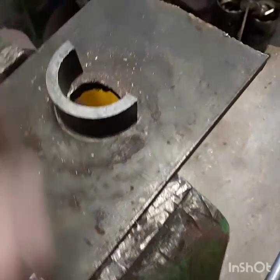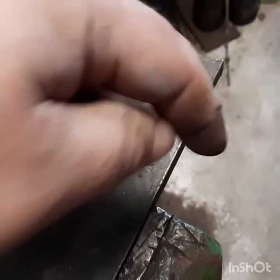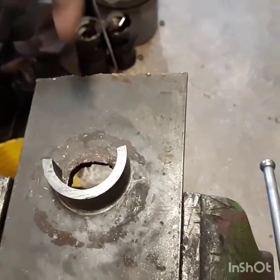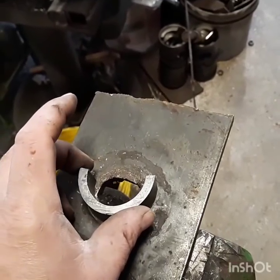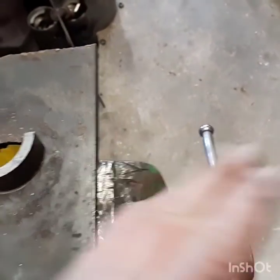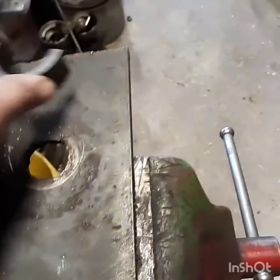I'll torch this plate to fit the bushing. This top piece will go away; I'll torch the plate to fit and come across the top, because there's a lot of weight on that piece so the concave bushing can't just jump up and out. I might rotate this a little bit because there's a tremendous amount of force coming down when you hit a slug of beans, and some force going back too. The biggest thing is to get this welded on the bottom, and then there's the beam of the combine right here — I'll figure out how to get over to that for a little extra kicker for support.